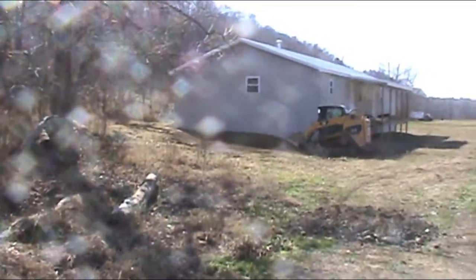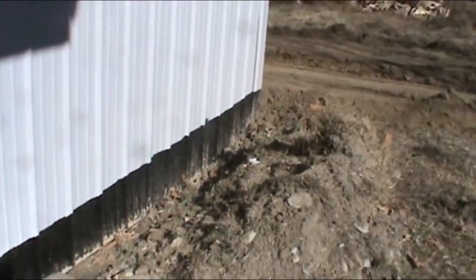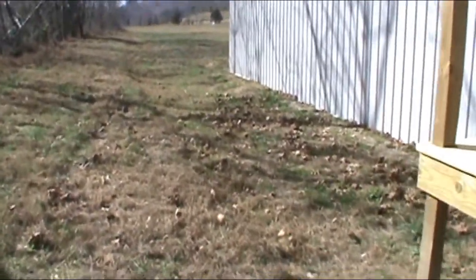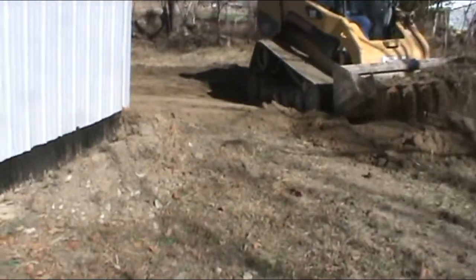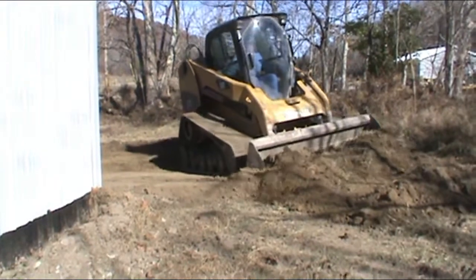He's landscaping around. The man that put in the septic tank really knows his stuff with that machine — he does not waste his time. You can see on the back side of the building we painted tar up to where the dirt approximately should come. If we left it as is, water would run under the building — same as it was at the house. The gentleman that did the excavation said if he built up, we wouldn't be able to build for a year because the pad needs to settle. So instead he dug down, which put our buildings kind of in a bowl. To fix that, we have to build up dirt around them and slope it away, but it does give us a deeper crawl space we can utilize.